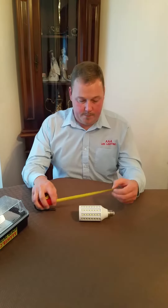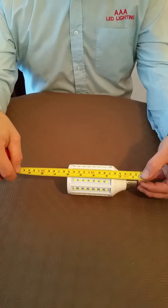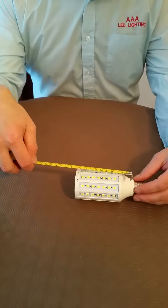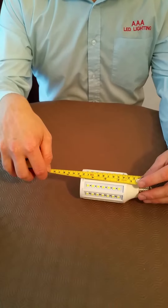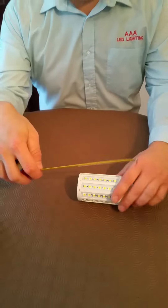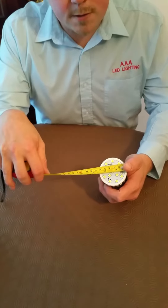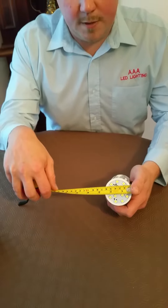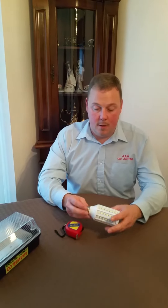Now the total length of the bulb from the bottom of the thread is 6 inches. From the point where it would disappear into your ceramic fitting, it's just shy of 5 inches, which is 124 mm, and the width is two and a half inches, which is 6 centimeters. This is available in 12 or 24 volt DC, or 110, 220, 230, and 240 volt AC. Many thanks for watching.